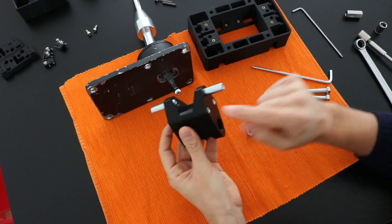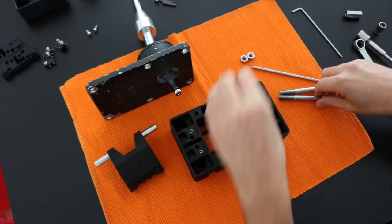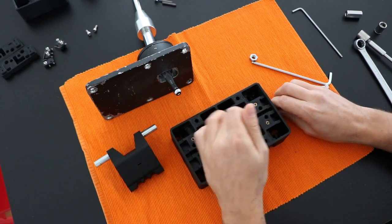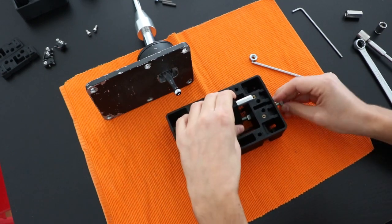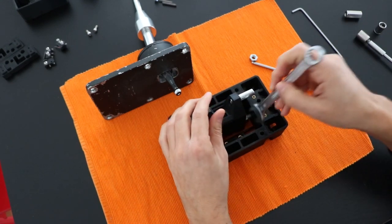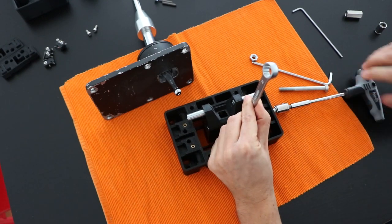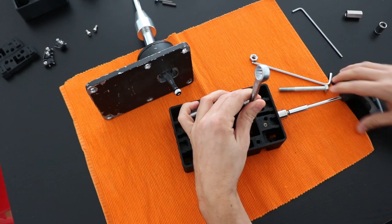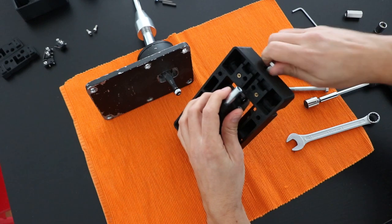So now that the first step from the offset lever is assembled, we are going to put it inside of the bottom case. The best way to do it is to insert here the first nut bolt and put this nut till the end, and then put the offset lever here inside, screw it directly here, and what I like to do is to use this tool here inside, and then with the extra tool you make this nut threaded strongly against the bolt first, and then we screw the bolt till the end